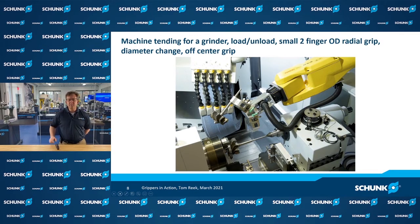Another concept with gripping and robots is dual end effectors — and sometimes end effectors with three or more grippers. Here's an end effector where a robot handles two parts, loading parts in and out of a process. Looking at the demo, one gripper picks up a workpiece while the opposite gripper is ready to load the second, so the robot only has to take one trip in and out of the process rather than separate trips for picking and replacing parts.